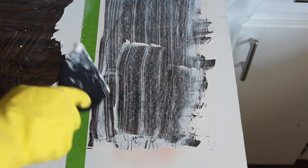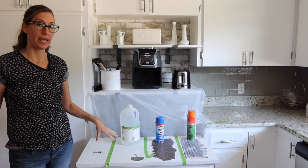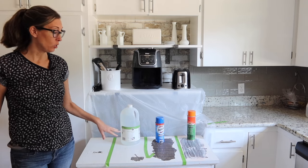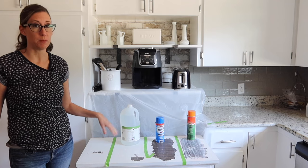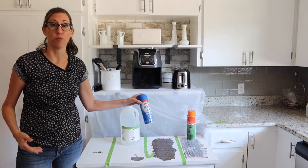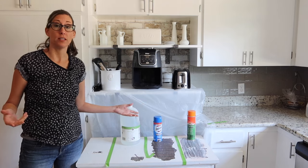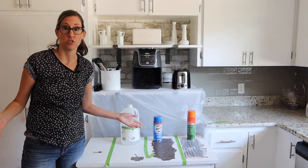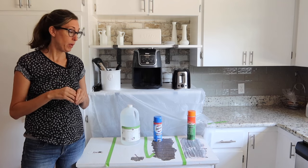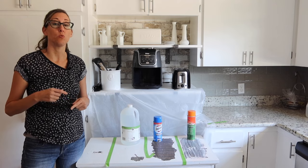I'll need to degrease and clean that after another layer. I should mention the paint on this dresser is a latex paint — just a general white water-based latex paint. It might work differently with oil-based paint, but anyway, my takeaway from all of this is that shockingly the Easy Off worked the best. It created the least mess, it was the quickest. I only waited an hour and 15 minutes, started to scrub, and the paint was just coming off. Whereas with the Citrus Strip, it did penetrate the levels of paint well, but ultimately it required another layer.